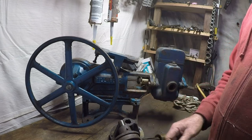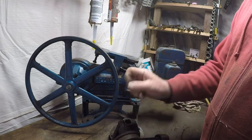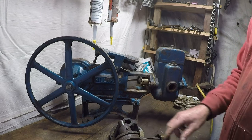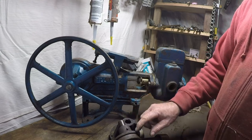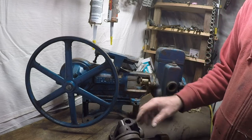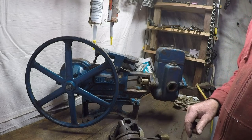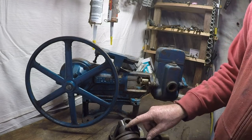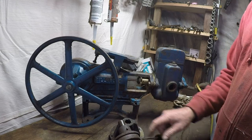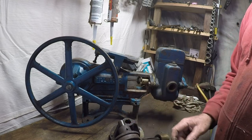It needs something that's hardened - you can't just throw a nail or screw in there, it's just not going to work. These are actually knurled on the shaft, pressed on, and then pinned after that. So it's not one of the things that gives often, but if you service a lot of them, you'll see it every now and again that it's sheared off.